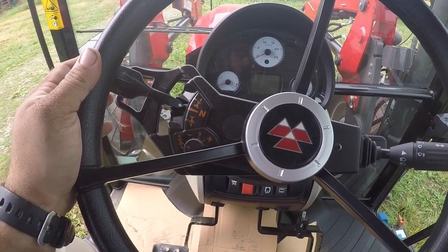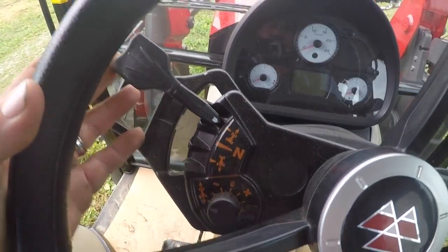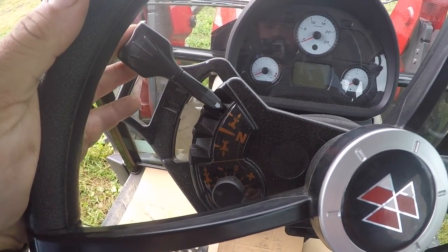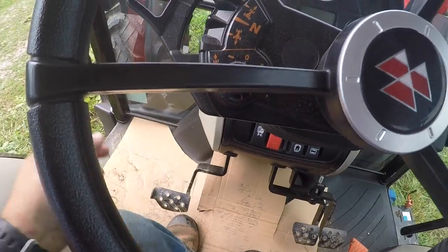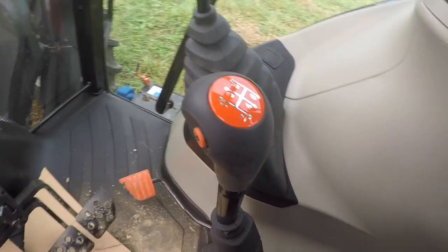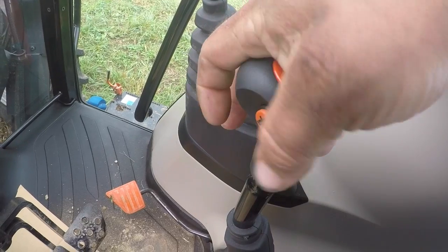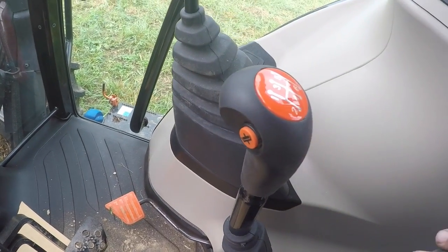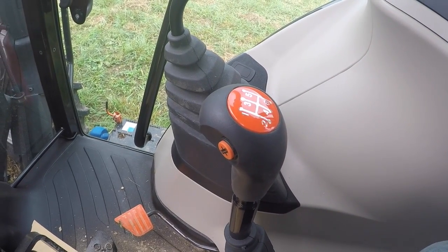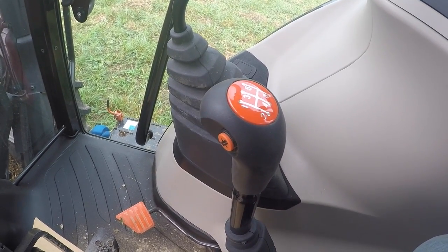I like this shuttle better than the one in my T5. Once you put this in gear, if you want to clutch, you can pick it up and it goes back to neutral without having to push the manual foot clutch. There's also a clutch on this gear stick, and that's a handy feature because you can use that to shift gears and never have to push the foot clutch. It changes very smoothly — every time I shifted yesterday, that's how I did it, and I was very impressed with that.